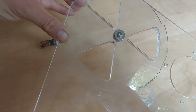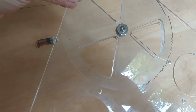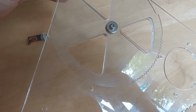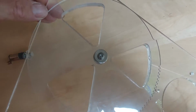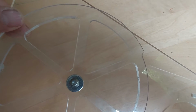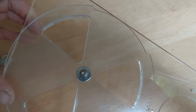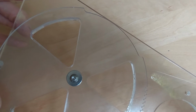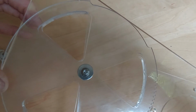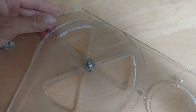But what I thought I'd come up with is a little motor with a gear on it, and then gear teeth on the outer circumference of that circular vent. And what I'm going to come up with next is just a little dowel pin here, and there's an indent, and then that will index round and hit the other side of the dowel pin in the closed position. So rather than using limit switches, I'll just have a manual stop, so it can come round that way, come round that way, and so I don't stall the motor or damage the gear train.